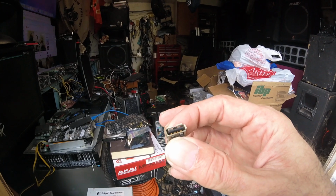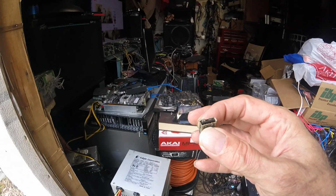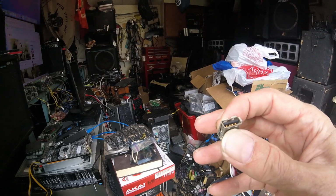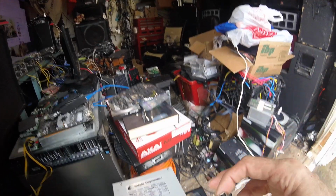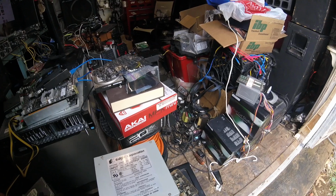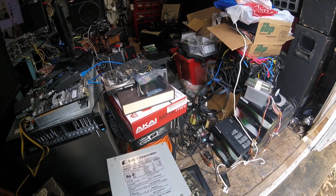Well, most of the chargers you buy, and be careful fast charging lithiums off of something like this. Most of the little wall warts that you buy are like 2,000-3,000 milliamps. That's 2-3 amps, maybe 4. Well, this sucker's got 20, and if everybody's plugged in at once, it's not going to be quite that much. Everybody's probably going to get 1 or 2.